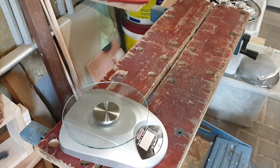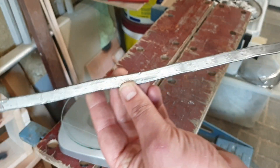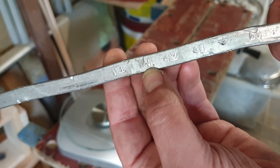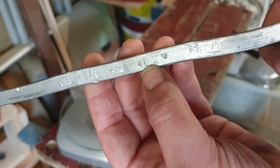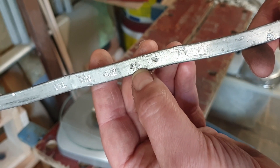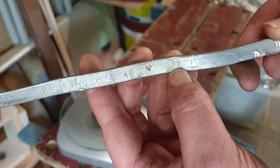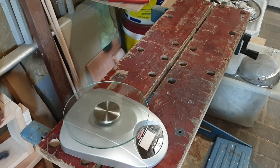I've been looking up some statistics on what bronze is used most for casting, and it's usually a 12% tin, 88% copper ratio. Recently while at work I found this tin rod — it says 'tin' and has '422' as a product number with '4060' on it. I looked this up and it's actually 40% tin, 60% lead. So I'm not going to be using this, obviously, because I don't want bronze with lead in it.